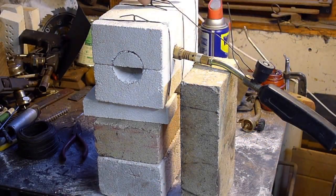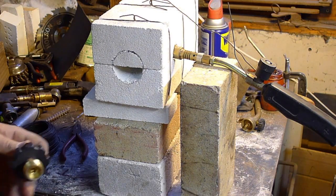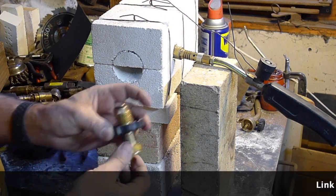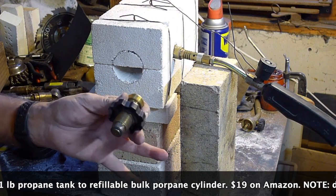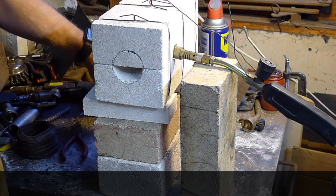I've put a little binding wire on one of the top things to hold this in place. These little propane canisters freeze up pretty quick — they get cold fast. You can put them in a bucket of water to keep them from freezing up. But as they get colder, the pressure goes down and your heat goes down. You can buy an adapter — one end connects to the back of this torch and the other goes into a regular barbecue propane canister, and it'll never freeze that up. If we're doing forging, you would want to use that. I would recommend it at least.